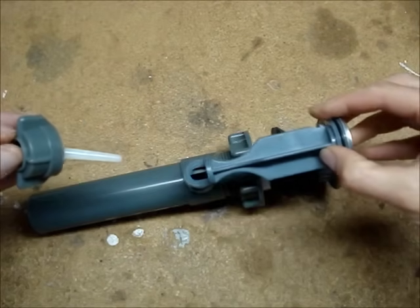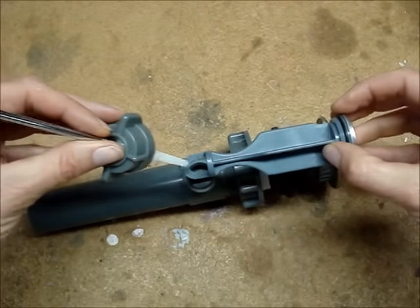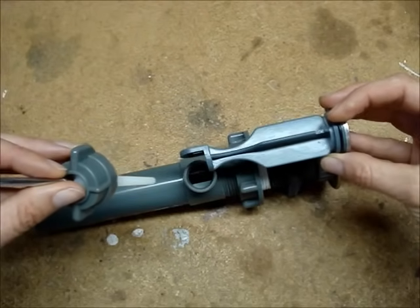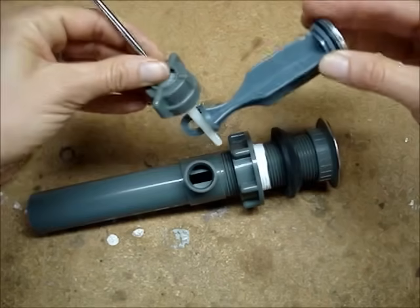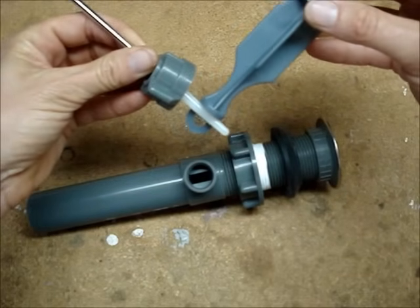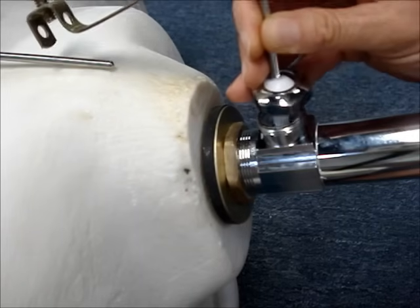If you line up the loop in the stopper so that the pivot rod goes through it, it'll be non-removable. If you turn it 90 degrees and put the pivot rod through, then it'll be removable and it'll raise up and down by riding on top of the end of the pivot rod. Install the pivot rod into the drain body.